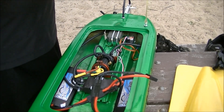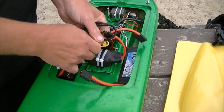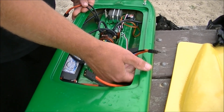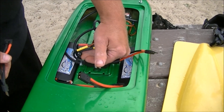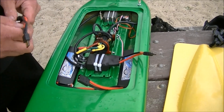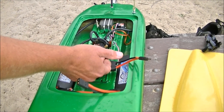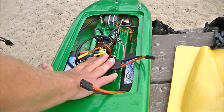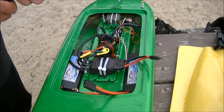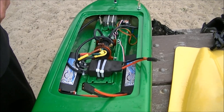I've got more than enough amps in my batteries. These are 60C by 120 discharge rate, 6,500 mAh batteries, so they provide tons of amperage to run this. My batteries are just lightly warm — I expected that. The ESC is a little on the warmish side, but nothing major. It didn't heat up to the point of melting the casing, which did actually happen on my 125 before it died. So this thing is not running quite as hot, which is good. I'll end this section and give my final opinion — pretty disappointed about no reverse.